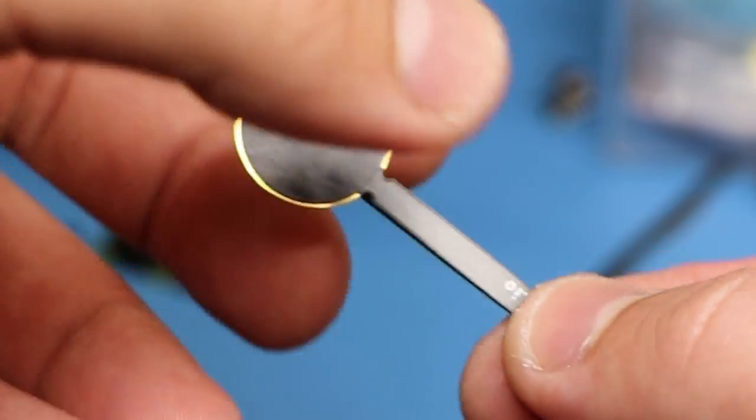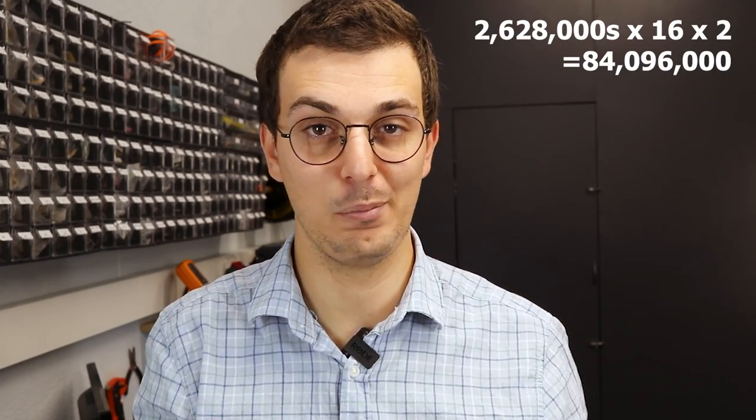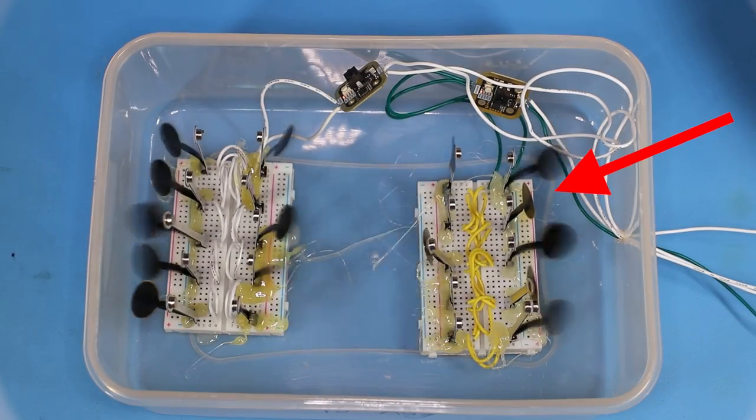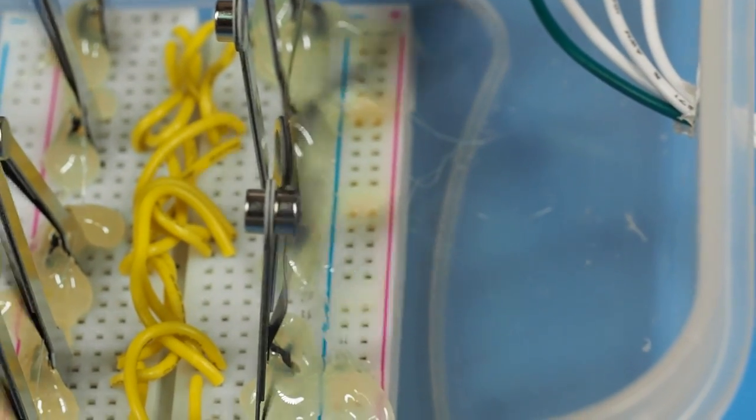So I remanufactured the PCBs and this time used aluminum stiffeners, which were much more robust. I tested 20 samples running at 16 Hz, and after one month each sample had made more than 80 million flaps in both polarities. Almost all of them survived except for one; another one had its magnet detached, probably because it was too close to another sample.